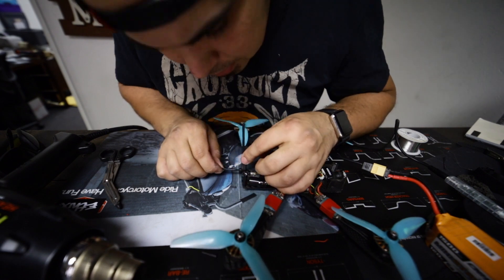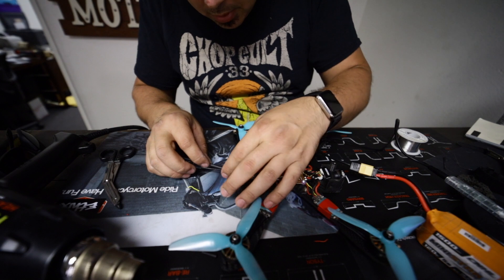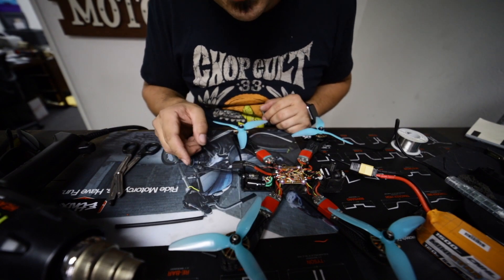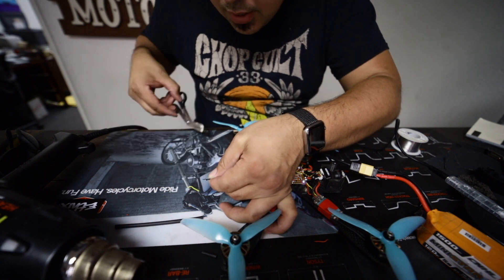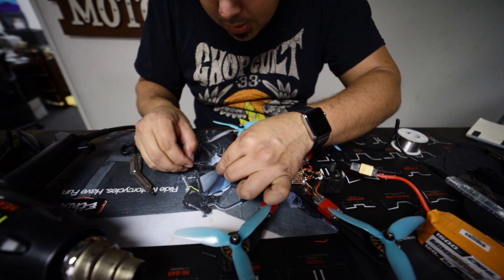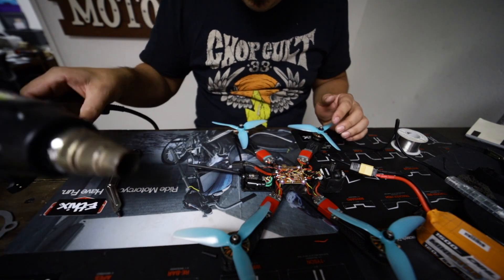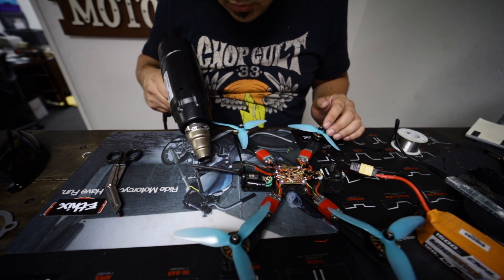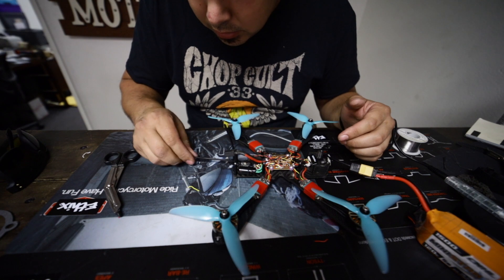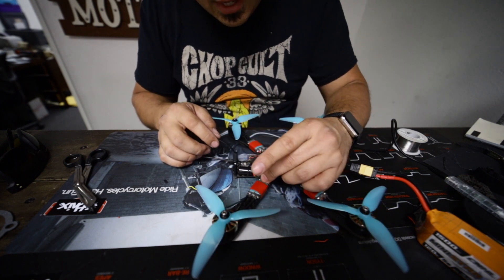I run this guy along here and I'll get another piece of shrink tubing, pre-cut. Since this one's closest to the bottom I take off a little bit of the tail - I don't want it as long. When I do the shrink tubing I leave a little bit of tail and close off the top, just kind of seal it in there. When it's nice and hot I pinch the end of it, trim it, and that's pretty much it. This little pigtail guy hangs off the side over here.